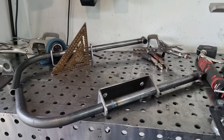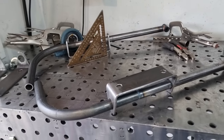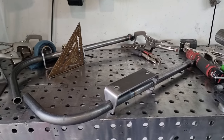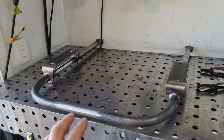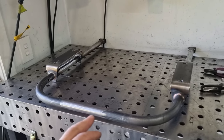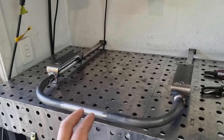Nonetheless it's starting to take shape. We've just got to bring these back into position, roll them on, and yeah it should look something like that. Here goes the lower hoop. We had to add a little section in the middle because these 90s weren't quite long enough - only 21mm there, quite gutting because it was nearly size for size.